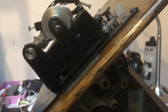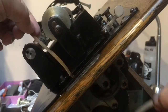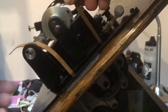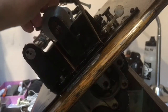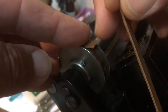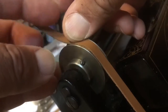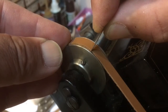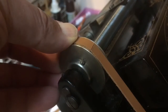Now if we observe the machine, here's your mandrel pulley. The belt will go down through the bed plate, around the motor drive pulley, back up through the bed plate, and then when I mend a belt I like to lap it over on the pulley on top. I'll change my camera angle to show you. Here we are on the mandrel pulley. We're going to position our belt like that and then put the other piece over like that. Now we grab our trusty razor blade. Notice where the end of the belt is right there and then cut a little line just like that. Now we can remove the belt and put the bevels on the ends.